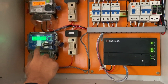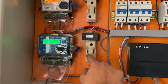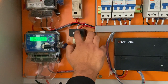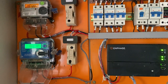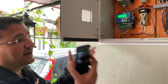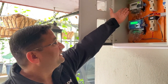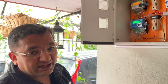This is the bi-directional meter. The power from the grid comes into this bi-directional meter. The output is connected to a fuse and there is a consumption CT. To measure consumption in the house we use this CT, and it goes into the MCB from where it is further distributed. This Envoy here captures a lot of data — daily production, monthly production, weekly production, consumption. This generation side meter gives the generation of the solar panels. Let us try to cross-check between this meter and our Envoy.